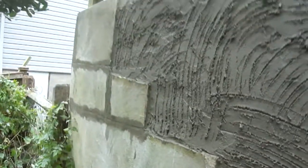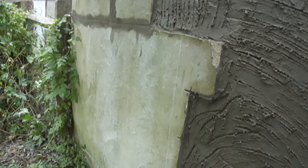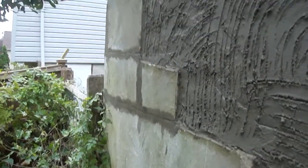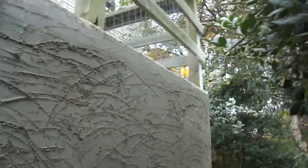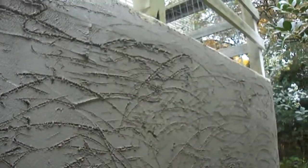I just discovered something about this — it's never going to match. He was going to cut that off in little pieces so I could throw them in the dumpster, and cut them off with a sawzall, and replace the rotted blocks underneath. But I found this out today: it's all rotted away. The cinder blocks are rotted under here. Maybe some of these are better than they were on the other side, but this much has got a lintel in it to hold up the concrete slab. From about here to the end, I don't have any reinforced concrete strip in there — it's just cinder blocks supporting the weight of this porch.